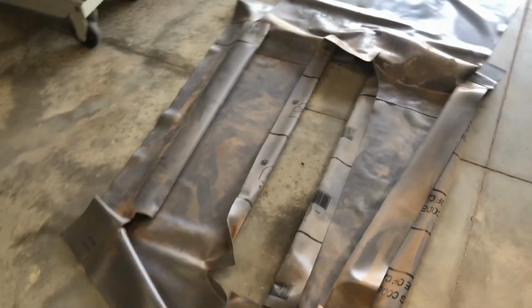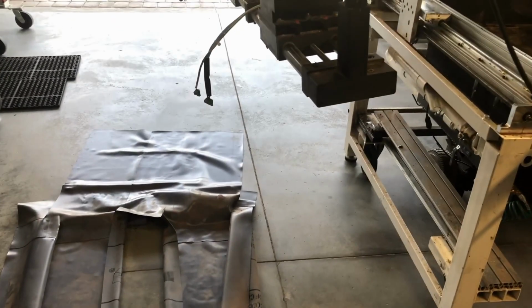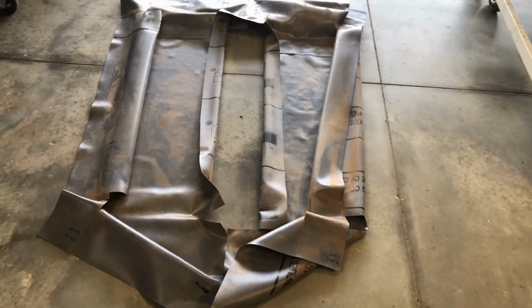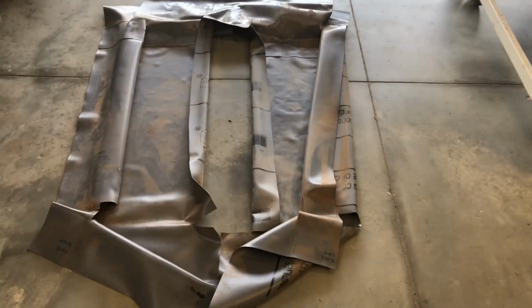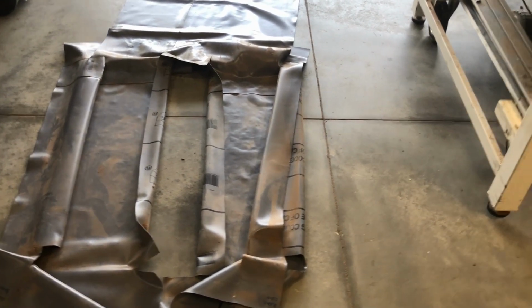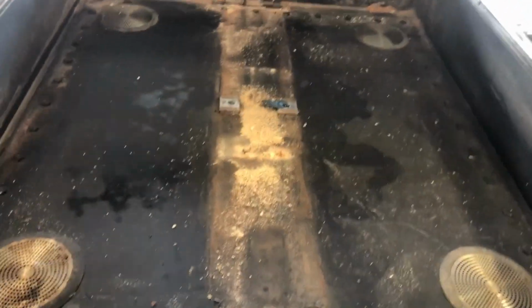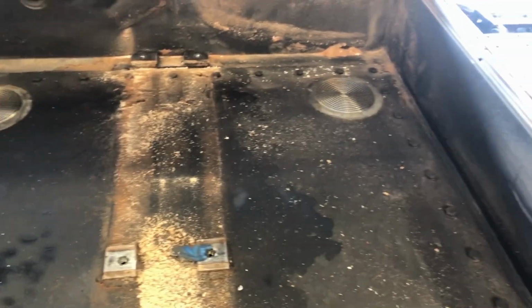Now, you might wonder what that is laying on the floor. Basically, once I put the 4th axis in, I use a shower pan liner, which you can glue. It's meant for when you're trying to put a shower pan in your shower. You can cut it and glue it to any kind of size you want really quickly. So I use it as a cover, and if you see, it keeps most of the dust out of the dual chamber water table, but it definitely keeps it away from the drains. So it makes for my cleanup a lot better. I just vacuum that out, clean it out, and I'm ready to put water in here.